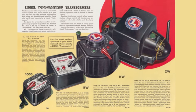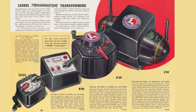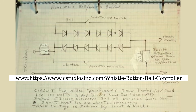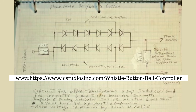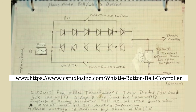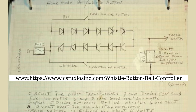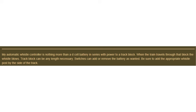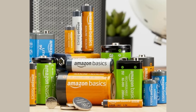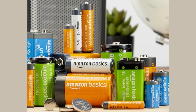I don't personally need a controller on my layout, as all of my transformers include the necessary features. But while researching a completely unrelated project, I stumbled upon a thread discussing options for wiring a DIY whistle controller. The main post contained a wiring diagram showing how to link a series of diodes to create the necessary DC voltage offset to activate the sounds. It's not a complex circuit, but it involves a bit of soldering to link all those diodes together. Then another post on the same message board said: why not just use a D-cell battery to make the DC signal instead of diodes?